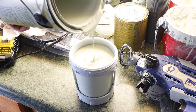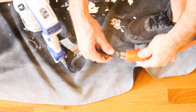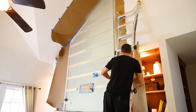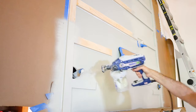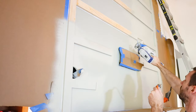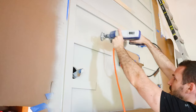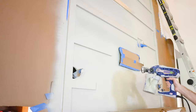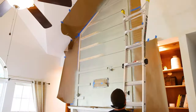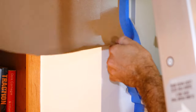This is the simplest air sprayer I've ever used — just fill up the provided jug, screw on the lid, screw the jug onto the sprayer, squeeze the jug bag until there's no more air, plug it in, and get to spraying. The strategy is to spray at an upward angle then a downward angle to hit each side of the wood slats. When squeezing the trigger, never hold the gun still or it will leave a splatter — always keep the gun moving. Imagine hand-painting each edge of these boards, all the corners, then coming back with a roller for the wall and face of the slats — there's just no way. Ripping off the tape reveals how crisp and clean the lines are — just a couple of spots I'll touch up.